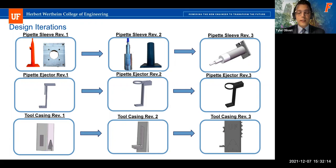For our pipette ejector, revision one had a cylindrical extruded face on the bottom. When we were assembling it over time, that part snapped off. So instead we removed that extruded portion, created a through hole, and added a feature on the tool casing — visible in the bottom middle area — to fit a dowel pin. The dowel pin is press-fit into the tool casing, and the spring is fed on top of the dowel pin.